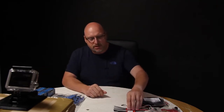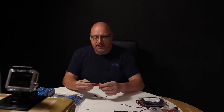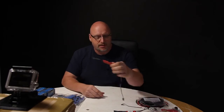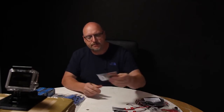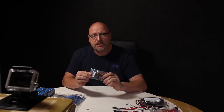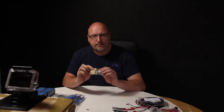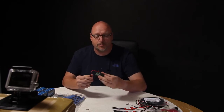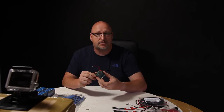We've got ESCs — these are Pro Flight UK ESCs, SimonK flashed, 30 amp, which are pretty good. We've also got male-to-male servo leads and some Hobby King little cushions — gyro foam — for the KK board. The KK2 is going to be flashed with the 1.6 firmware, which I've had on my quadcopter and it works flawlessly.